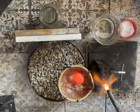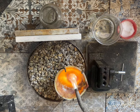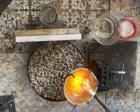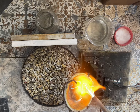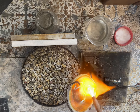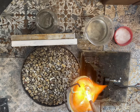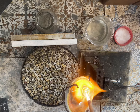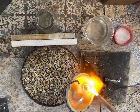Now that the silver is molten, I'm preparing the ingot mold. I normally heat up the ingot mold for about five seconds, then move back to the crucible and continue to heat it, kind of jiggling the silver around — it helps me see that it has fluidity and motion. You want to make sure the silver is completely melted. Out of trial and error, I always do this process for about 30 seconds.